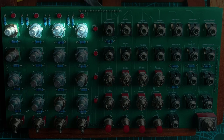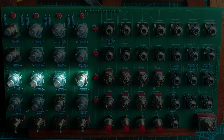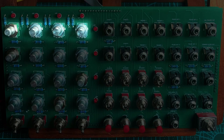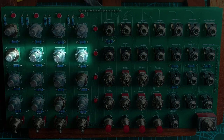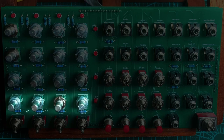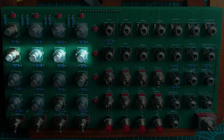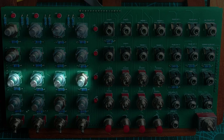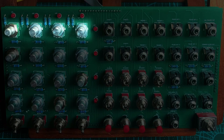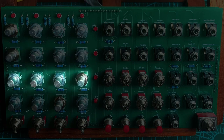The original design focused mainly on four stages, but in this version, we can also start to consider these individual four rows, as we can see moving them here. They can be moved by passing a clock input to the input that makes things move from top to bottom. So now you can start to imagine why the name matrix comes from, with outputs going out on a per stage basis and also a per row basis.